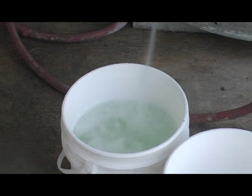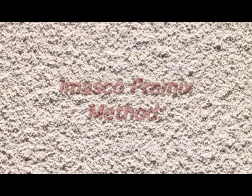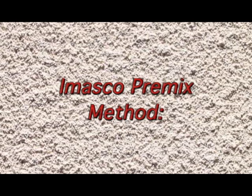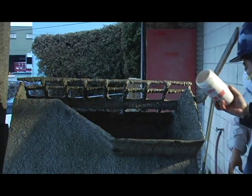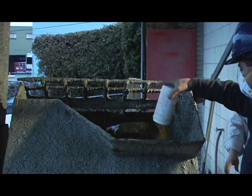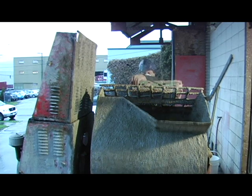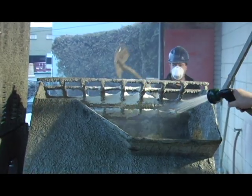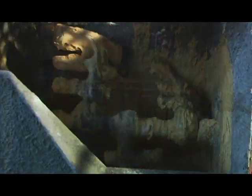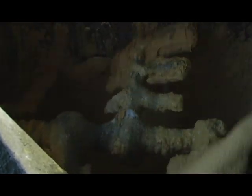Always measure and use the same amount of potable water per mix. Amasco recommends the following method: in a clean mixer, add 4 litres of water, then add all containers of Amasco colour. Once the colour and water have been thoroughly mixed, gradually add the Amasco pre-mix and the balance of water to the ratio required. Once all material is in the mixer, mix for an additional 5 minutes and the finish coat is ready to apply.